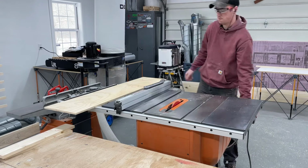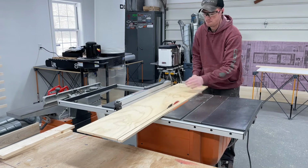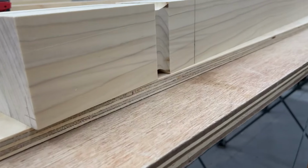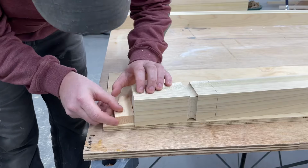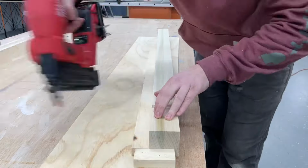Next I could add the taper, but first I needed to make a quick jig. I just set the table saw fence at a random dimension and then ran a piece of scrap plywood through. Then I could set a leg on the plywood lined up with the edge where I wanted the taper cut. To make the cuts quickly repeatable, I just brad nailed some strips on the 2 inside edges to act as fences.